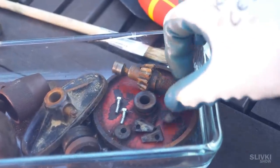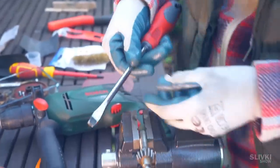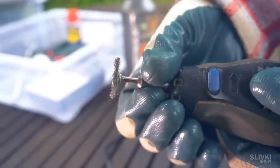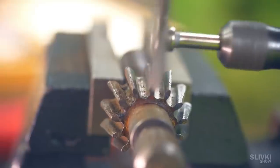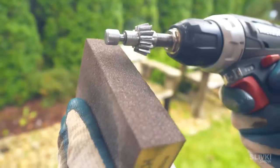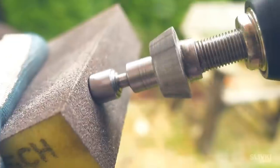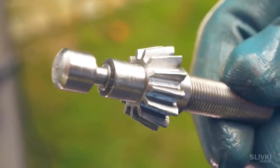The next part is the shaft with a small gear. We brush away what we can, but the grease and dirt between the cogs has been fossilized for a long time. So we use a small wire circle brush on the drill. It does its job, but the final finishing is done by a larger wire wheel on the drill. We fasten the shaft in the chuck and clean the smooth parts with an abrasive sponge the same way as before. The result seems to be very good.